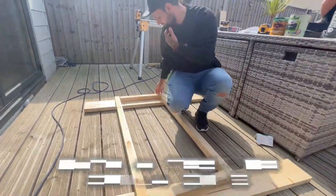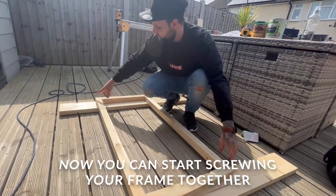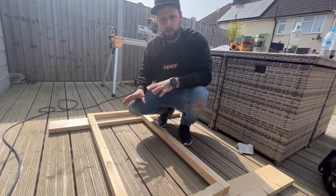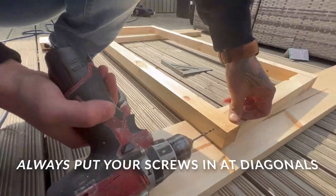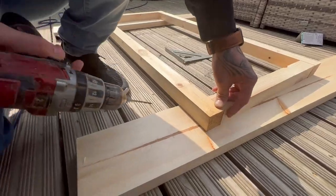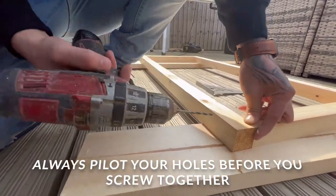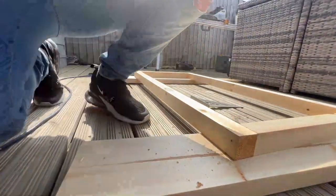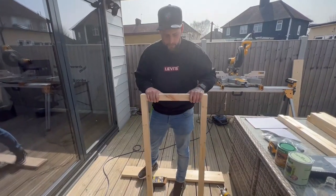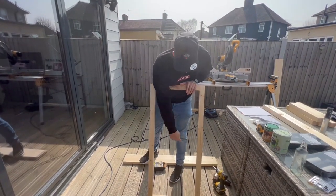What we're going to do is literally screw these four pieces together, and as long as you've done nice square cuts it should go together fairly square. You can check this by measuring the diagonals. You want to pilot your holes - we're keeping it simple, not putting any diagonal bracing in. When you put the two screws in, put them at diagonals - you never want to put them one above the other because you've got more chance of splitting the grain. We've got 70 millimetre screws. We're going to pilot it and send them in on all four corners, then move on to the next stage.